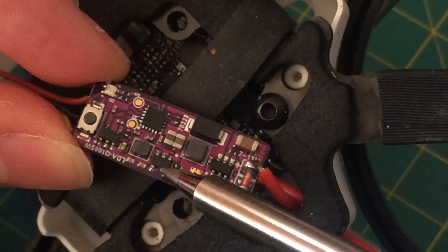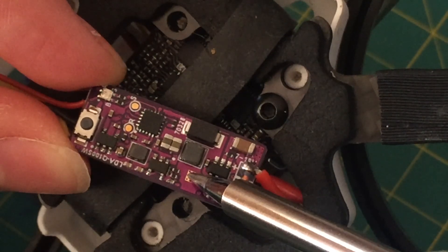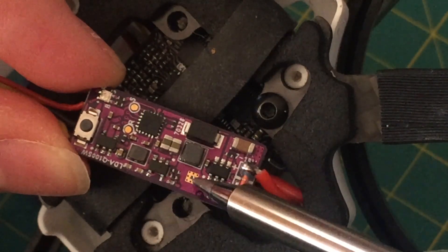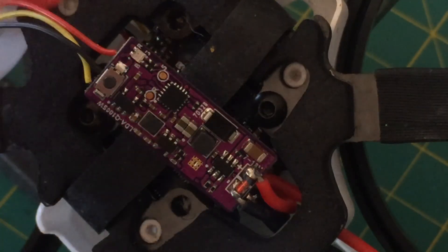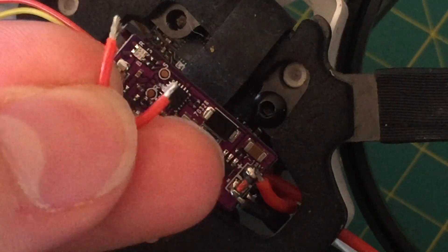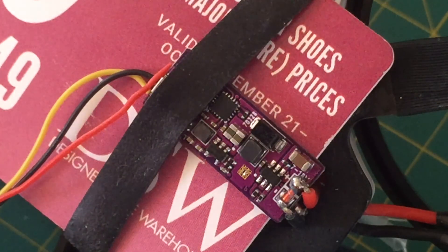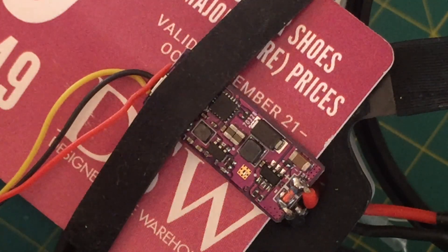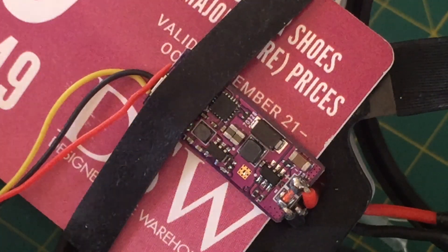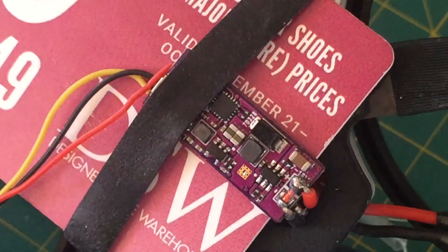These are the pins we're talking about. We're going to solder a jumper from here to this free little pad on the board — from there to there. I made a little wire loop; you can make yours shorter than this. I'd recommend making it a little shorter, but it was easier for me to work with. I put a little card underneath the ET-125 because I wanted to work with it while it was still in it without having to take it out, and you don't want solder to drip down inside the unit — that would just be terrible.